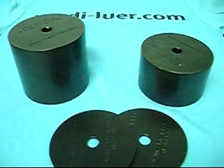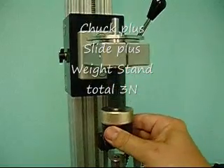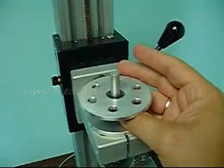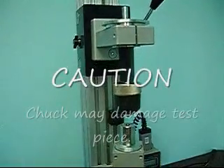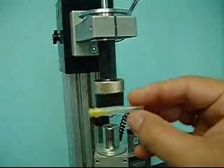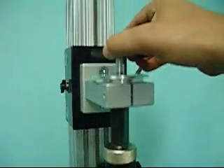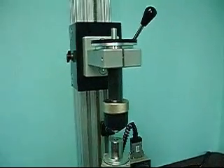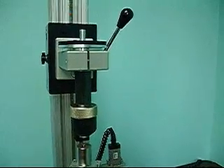The base weight consists of the chuck, the slide itself, and the weight stand on top. Those pieces total three newtons. If your part is a small needle, it has negligible weight, and you'll be able to use those three newtons in conjunction with the wafers which fit on the weight stand to make five newtons — and that then becomes your five-newton base weight. That weight could be used in testing in ISO 594-1.